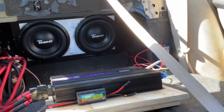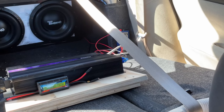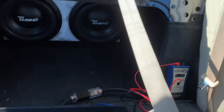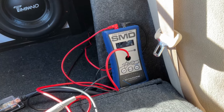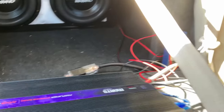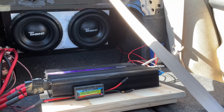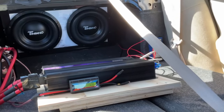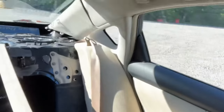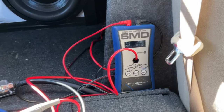Let's check out 40 hertz. All right, let's get the 40 hertz up until clipping — I got my dyno set over there. We got 5191 watts at 1.4 ohms — again a little bit shy. Let's go to 45 hertz. We're sitting at 13.32 volts. We got 1.3 ohms, 5071 watts.